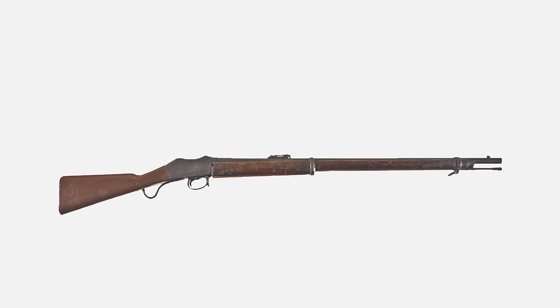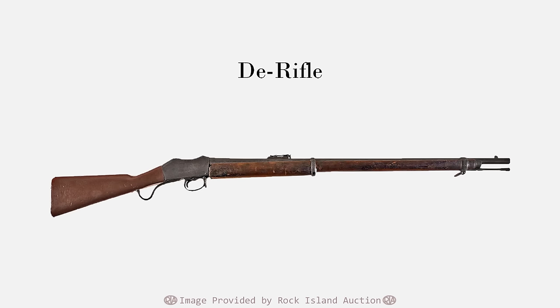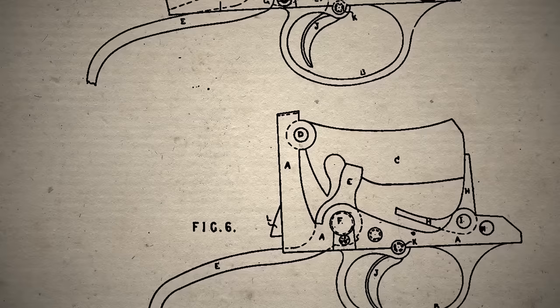While it might look like a Martini-Henry, minus its cocking indicator, this was actually a copy of a Francotte-modified Martini rifle. While the lockwork is nearly the same, it has been changed to fit in a sort of packet assembly, which could be removed whole from the receiver, making it easier to service. While the concept was good, the execution in Nepal was fairly poor, which meant that the locking strength suffered. Curiously, the breech blocks were over-hardened, making them likely to shatter. The barrels were formed on a mandrel by wrapping and hammering strips of frankly poor quality metal.